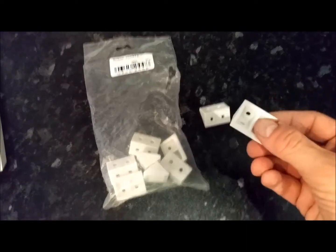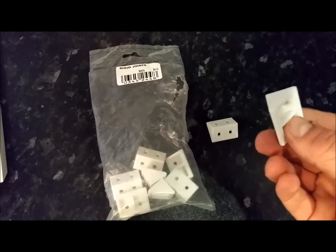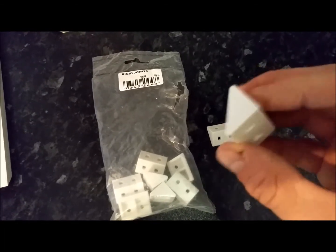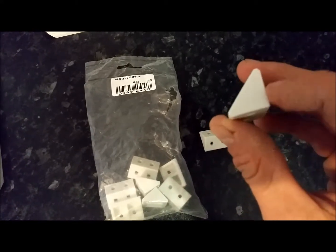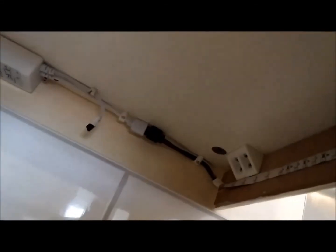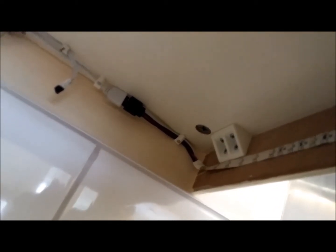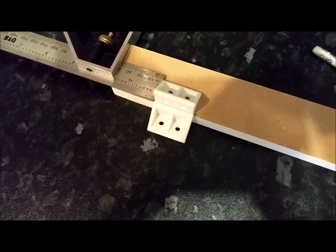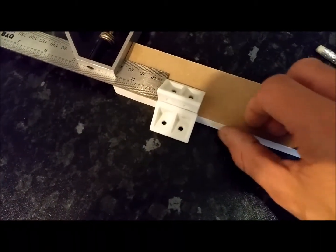Previously I've used these brackets — available at Wilco's, but you probably get them at B&Q or anywhere else. I quite like them because they've got quite a wide area. You could use furniture blocks, but these have got a longer length to them, so I find they hold everything a bit squarer. You can see how I fitted it underneath — that's an example of what we're going to do next. Use one of the other blocks to ensure that the block we are going to drill holes for is flush against this surface.